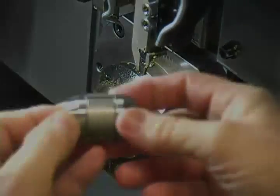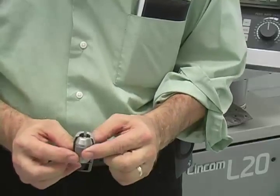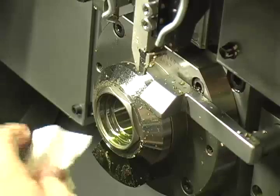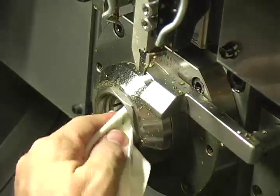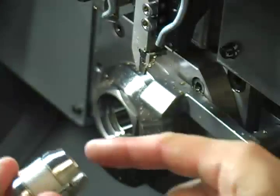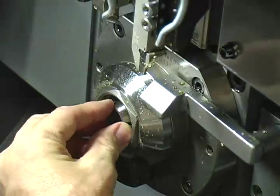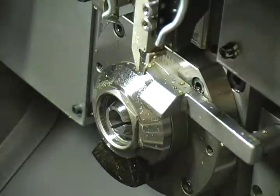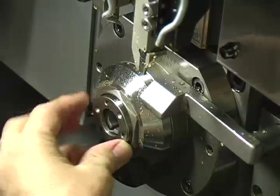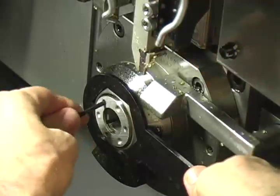This is a custom design for Citizen's new adaptive guide bushing. It self-adjusts up to five thousandths in diameter to accommodate the more affordable non-ground bar stock. Clean the spindle and clean the guide bushing before inserting it into the spindle. The chamfered end goes into the spindle to properly guide the bar into the bushing. Replace the spindle nose cap ring, tighten in place, and lock in the nose cap using the face spanner wrench.